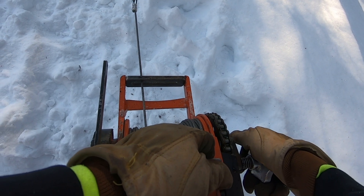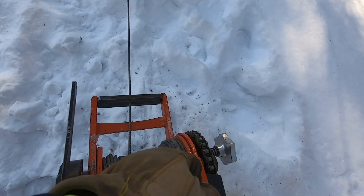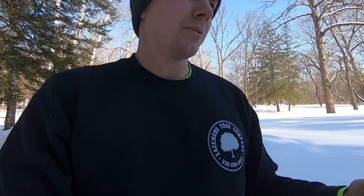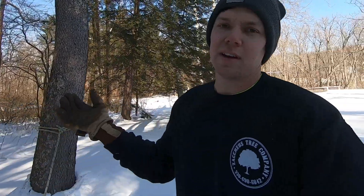This is also a little sketchy when you've got some rope stretch in there. Another trick: it comes with about 150 feet of cable, but if you only put about 125 feet on there, there's not as much to wind up and you don't get it all bound up. The reality is, at least for me, I almost never use all 150 feet — I don't think I've ever had it all the way out to the bare drum. This job gets really close, down to the last couple turns. If you're not making 150-foot pulls all the time, 125 feet does you fine, and you end up using it with the drum full more than empty.